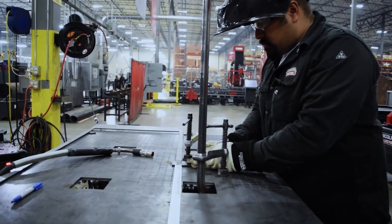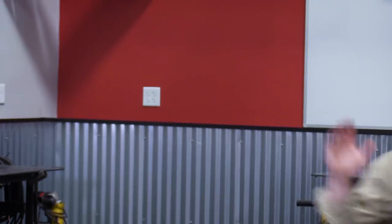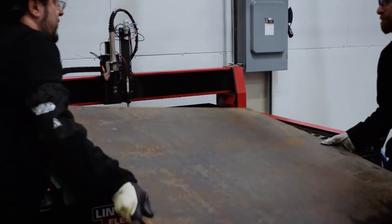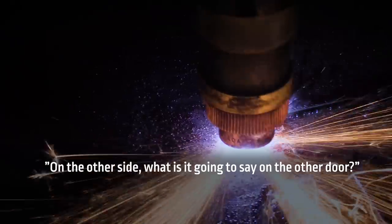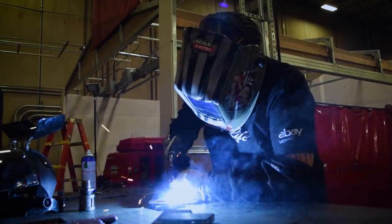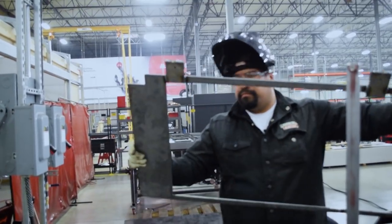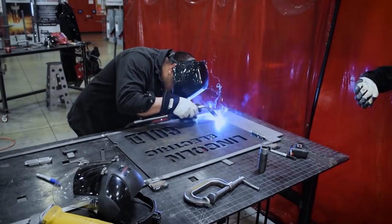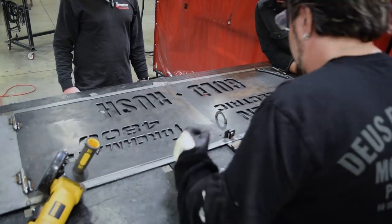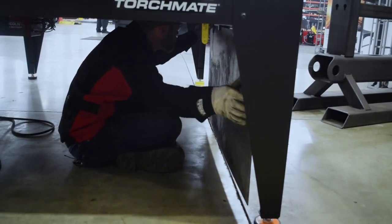With the tank passing our inspection, let's pivot to the table skirts and doors that will surround the 4800. Just in case you were wondering, the skirts are going to be hanging off the lip of the channel inside the 4800. For those of you at home that are going to be building this project, please don't alter your table — we don't want you to void your warranty. These guys will go straight to the bottom, lined up directly with the bottom edge. But this one will offset about three-eighths of an inch so that when the doors close, it stops directly on it without going all the way through. These just sit like that, and when the bolt comes out you can take them apart. Fits like a glove.